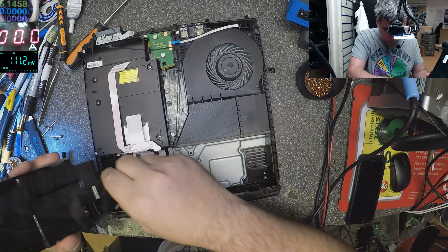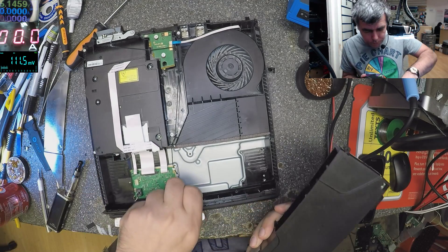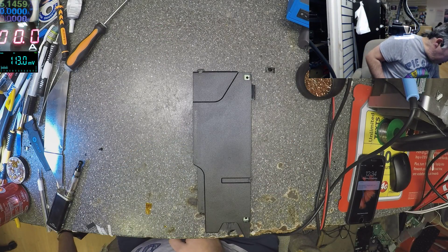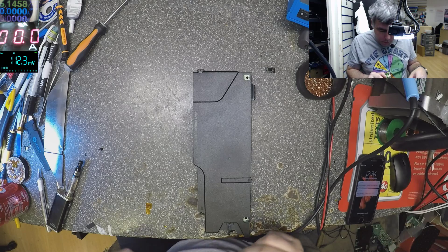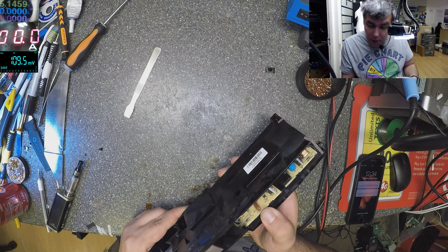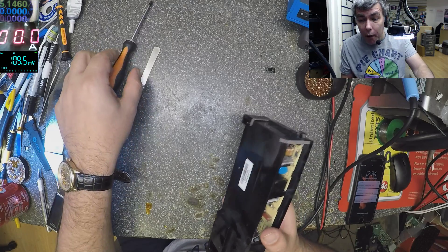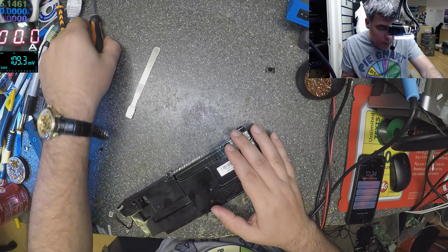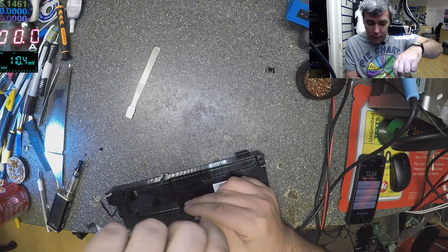So if I have no light, logically the 5-volt one is not working. Even there you have a main power rail from 220V, and from that main power rail it goes to the 12-volt power supply and the 5-volt. Even there can be a problem. Well, let's see, let's fix this one.